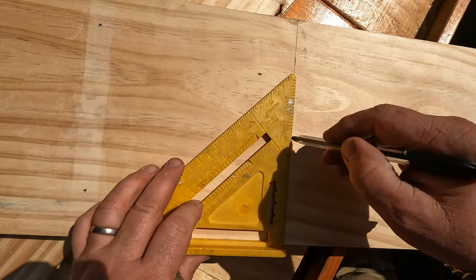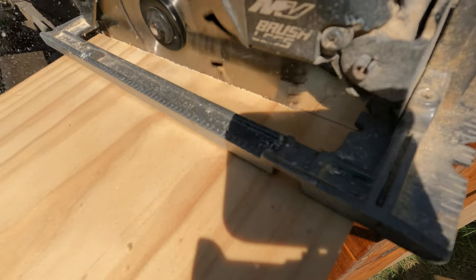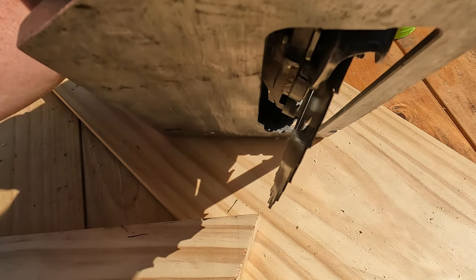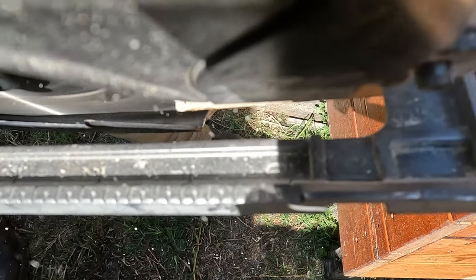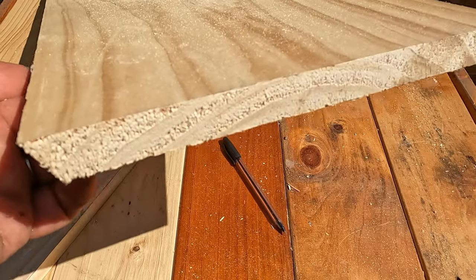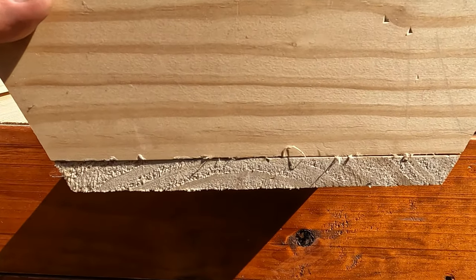Here I'm marking 1.2 metres, which is the overall internal length of the hive. Again, be quite safe when using these saws — I can tell you from experience they can cut. Now we use the follower board to set the saw angle; the top of the follower board is at the top and the angle going down the side is the side of the follower board. We use the saw to cut down the length of the bottom board, which creates an angle you can nail to that sits really nicely between the two sides. You can see an angle on one side and an angle on the other, and this piece matches up to the follower board.